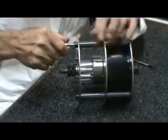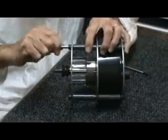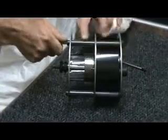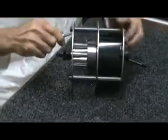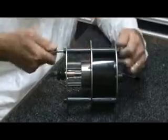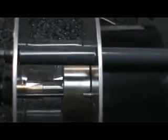Need a little bit more force — you don't need a big wrench. There's no wiggle. I just tighten the top one until there's no wiggle, just taking the looseness out of them. This is enough to compress it. I turn that down — see the gap? Just disappeared. This is enough tension to hold that against the plate.